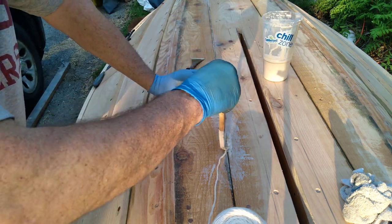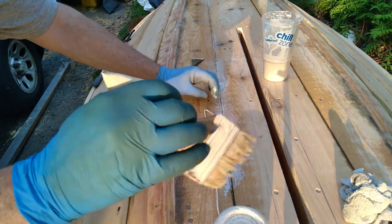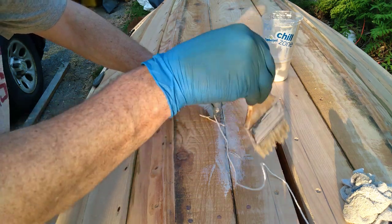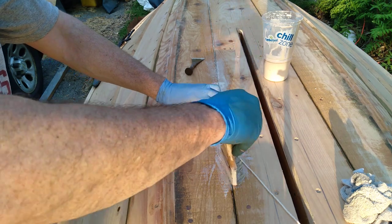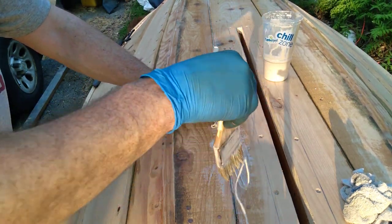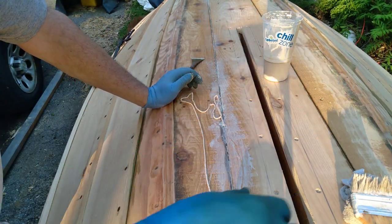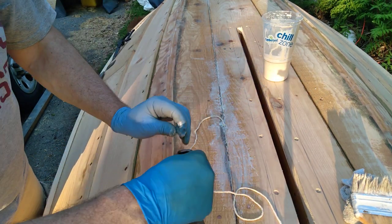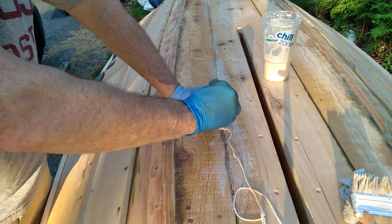There's only so much clamping pressure you can get on the bottom boards when you're riveting them together. You get as much as you can for sure, but there's only so much you can get. And then once everything's fastened and the whole boat's together, going back and caulking it is really gonna tighten up the bottom, which could only be a good thing on a classic racing vessel. Not that this boat is going to get pushed too hard, but couldn't hurt.